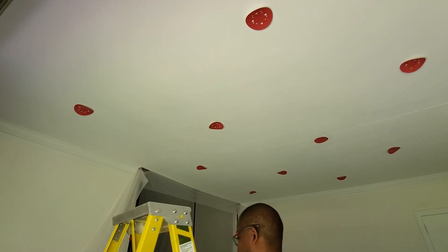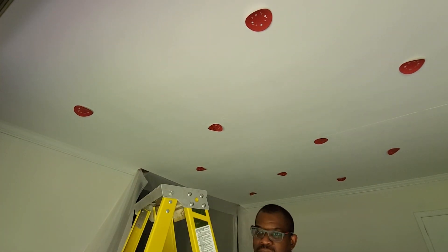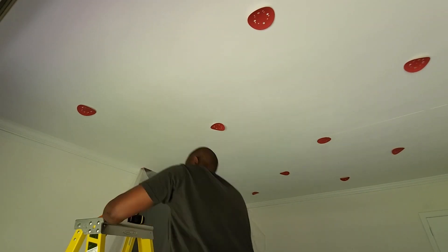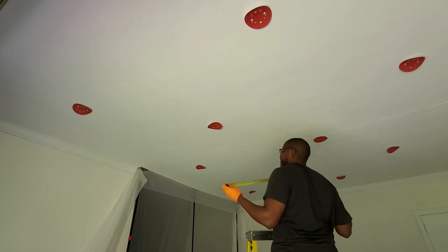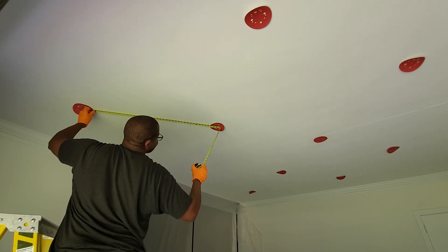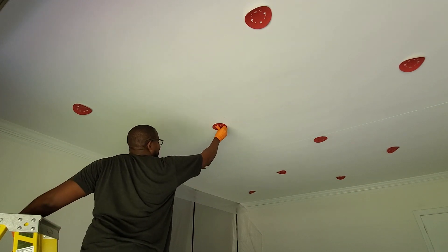I'm continuing to move around and fine-tune and adjust. In a moment you're going to see we move that laser — we could have five of these recessed light locations lined up in one line, and then we'll fine-tune the ones that are out of line. We're basically just trying to make sure we've got the light locations spaced out properly between each other, because that's something that'll be more difficult to determine with the laser than it is with the tape measure. It's already starting to come together really well.